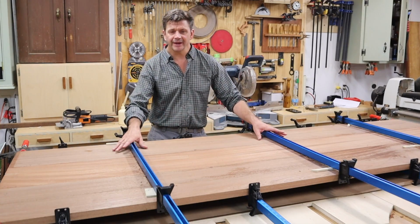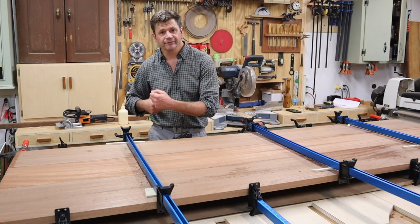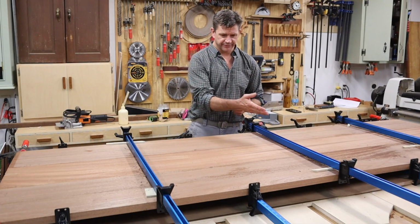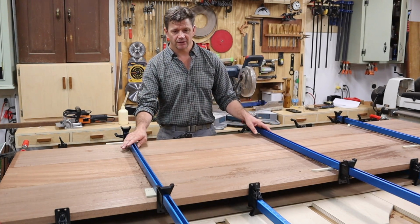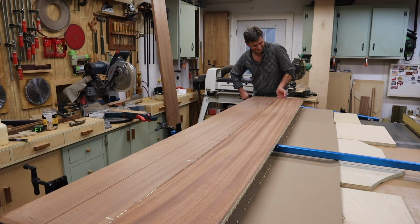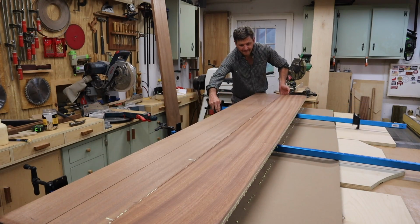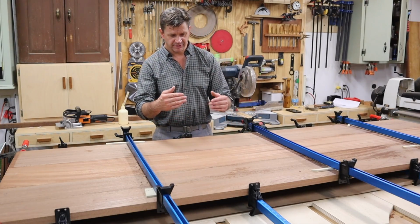And then I got my clamps ready, making sure to adjust them, make sure they're fully extended. And these are the Surefoot clamps by Rockler. I've been using these now for about a year. I really like them because they're very easy to use and very lightweight. And then I put the 2 halves on, made sure that the biscuits lined up with the biscuit slots.